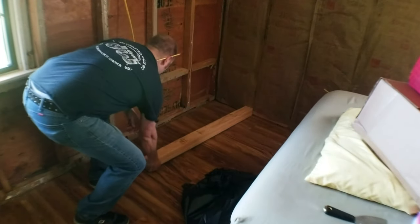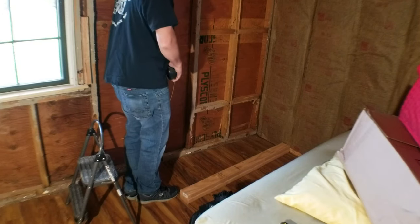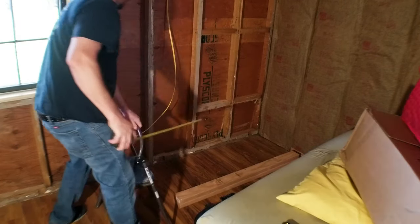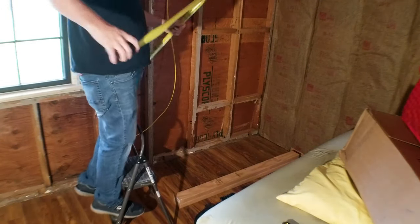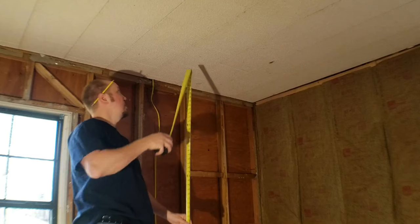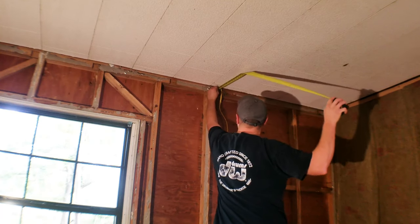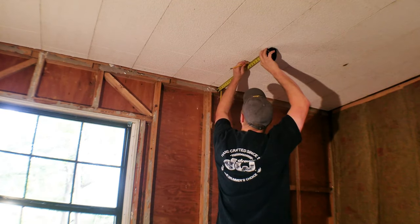In this video I'm doing some emergency surgery on a load-bearing wall. The sill plate in the corner here was badly damaged by water and termites, so I have to replace it. But before I can do that, I have to temporarily support the load above it. There are lots of different ways to do that.